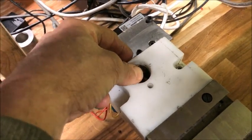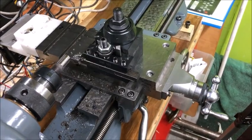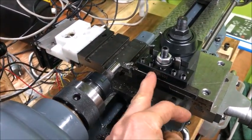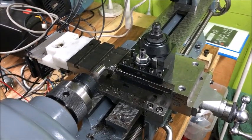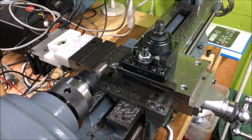To obtain the normal silky smooth manual operation, I can detach the motor altogether — just a couple of set screws. I have a rigid mount, and this being freshly scraped and aligned, it runs totally chatter-free and is very nice.